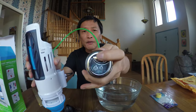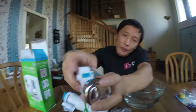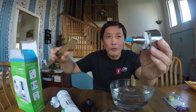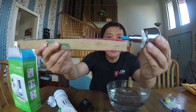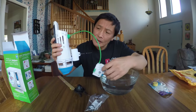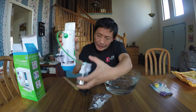This is the dual flush. On the top is a quick flush for liquid, and this is a full flush for solid. Let's look at what's inside. If I press this in, I can take this off. For a full flush it's this length, and for a quick flush it's only a half inch out. The full flush comes out one eighth inch more, and that difference translates to how high the flap opens inside.